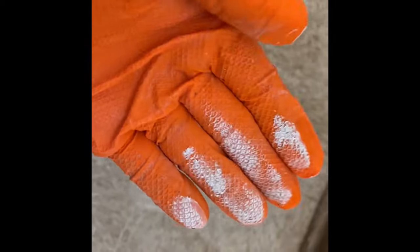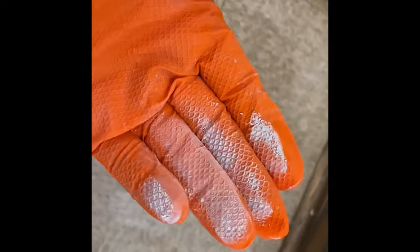I squeaked it out around that podium right there — see how nasty it is. I just want to show you right here — this is dried wax where I've got wax off the floor. Then what you want to do is rinse the floor until you don't have any of that. I'm actually going to scrub the whole floor one more time because I've got some patches I'm just not happy with — where chairs are rubbed and stuff. I've had to do that before with chemical stripping too when I've had build-up. I'm going to flip my pad over because I want it to all look more consistent.